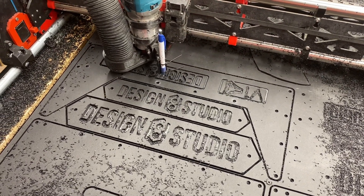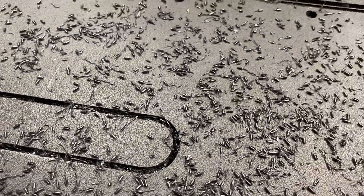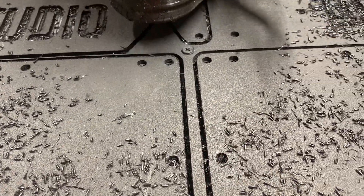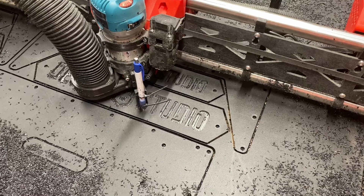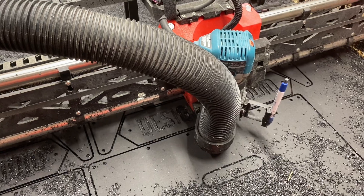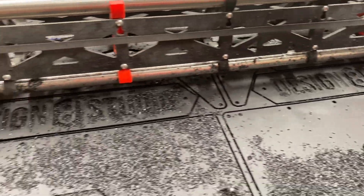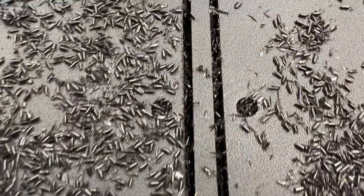You'll notice that when you're doing that, you're not getting chips. You're not actually excavating any of the HDPE away — you're just converting it from nice and smooth to this scalloped, rough, seaweed-looking mess that clogs up what you're trying to do. It's actually still attached, not loose. And even worse, the edges of your pockets and profile cuts have these scalloped ridges attached to the sides, sticking up and really ruining the appearance.